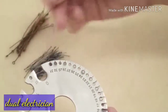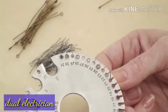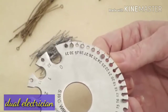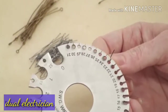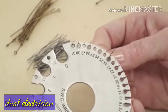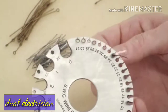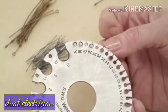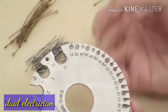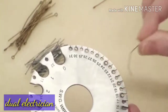I've got this little head pin in gunmetal and I can tell it's a bit thinner, so I'm going to try 21 — it goes right through really easily. 22 still goes too easily, 23 pretty easy, 24 — it went through so that means it fits. I'm guessing it's 24 and it's not going to fit through 25, and sure enough it's not fitting. So this is a 24 gauge gunmetal head pin.